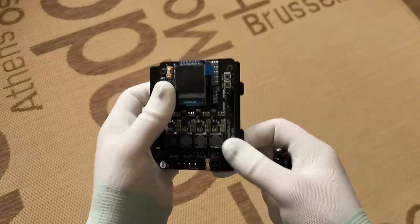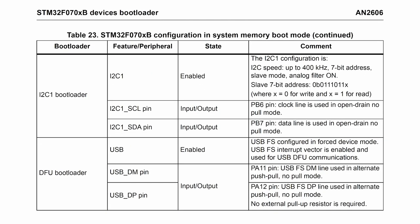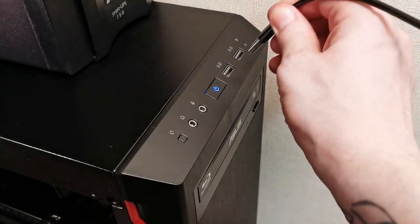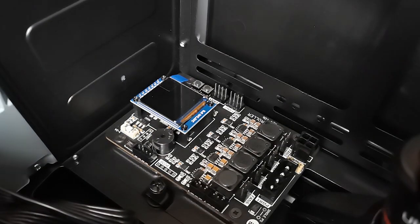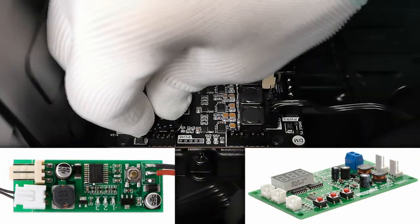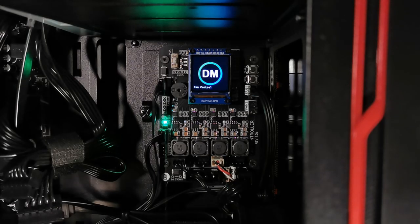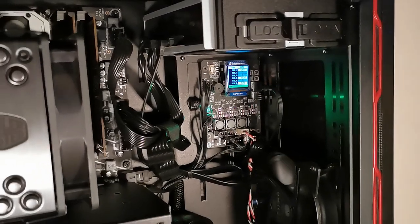I also found a bug in the schematic: I didn't check how the controller's pins behave when entering the bootloader. Turns out the buzzer pin gets pulled high, so programming via USB or UART means listening to an awful beep the whole time. I should say, I designed this device for myself, not mass production — but somewhere along the way I wanted to try making something resembling a commercial product. Not sure I succeeded, but the experience is definitely valuable. I saw something similar on AliExpress but it only had two channels with poor DC-DC converters — didn't make me want to buy it. So I had to make my own. That's all from me — thanks for watching, subscribe, leave comments, and stay in touch.